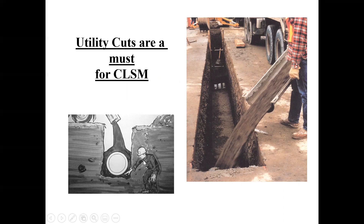With utility lines, maybe you have to put a new utility line in and the pipe is above where you dug. There's a bunch of random holes and you don't want any holes there because that's going to make the soil weak around the pipe and create more tension around it. So you need to put something around that pipe that's very flowable — you go in and pour flowable fill around it. Because with soil you have to actually move it and it's kind of hard to get around that pipe, but with a fluid like this, it can actually move around it like water.